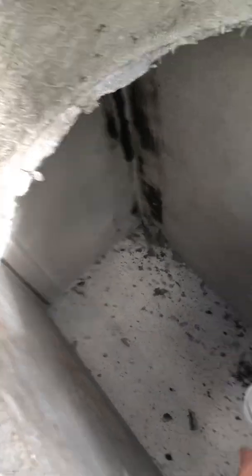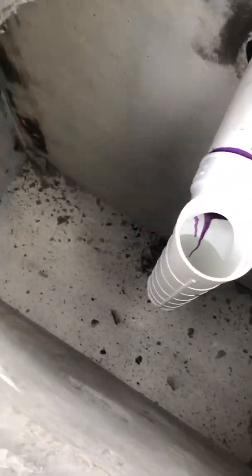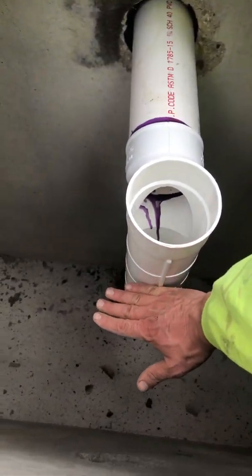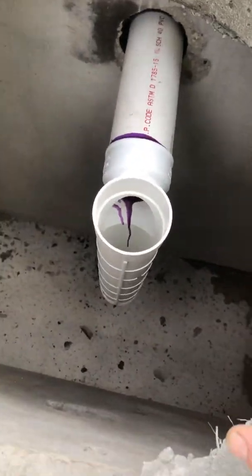It's leaving the clarified zone in here, only drawing water out of this clarified area. Ideally, the sludge sinks to the bottom and the scum sits up at the top. That's why you want to call a pumper — over time the fat builds up and the sludge rises, and once the sludge gets to the bottom of the inside of that pipe it'll go out to the field and wreck your field. That's it, thanks for watching — post questions below!